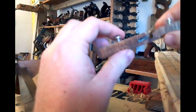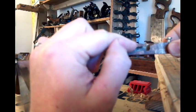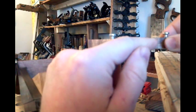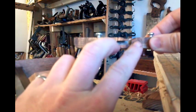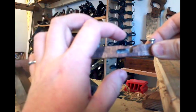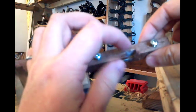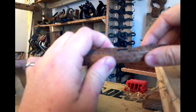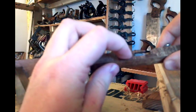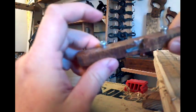Then I basically measured a path that I needed, put this wood up to the box, and marked where it would be when finished and about where I wanted it when moved all the way over — that gave me my length of path. It was basically a push of faith: I had the slotted key set up on the router table at the depth I wanted, pushed the piece in, then moved it over to a stop I had made to reach that location. That's what made that slot, and then I put the two screws in.